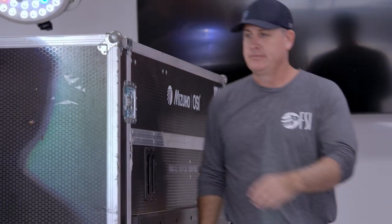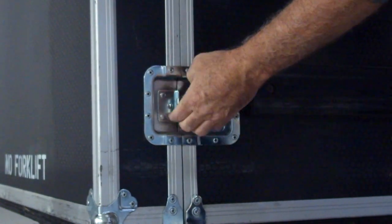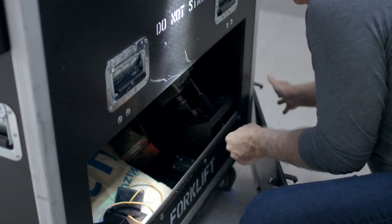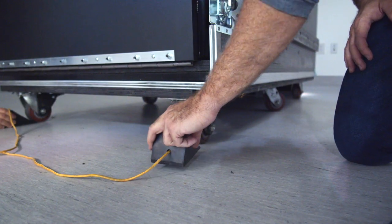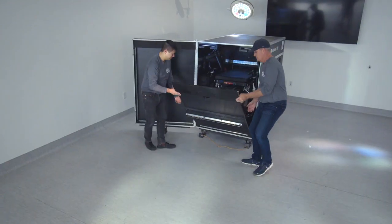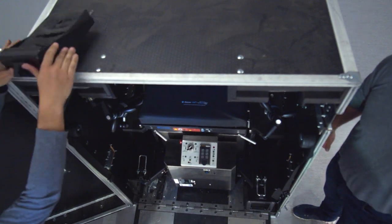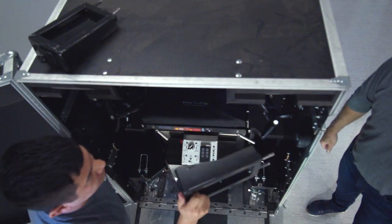On the right side of the crate, unlock the top and bottom latches. Once the latches are unlocked, open the crate door. Head towards the back of the crate and open the lower door. You should find in the bottom door a pair of wheel chocks. After getting the wheel chocks out, place them on the front casters to keep the crate from moving when you pull the table out. Unclip the strap that holds up the ramp and lower the ramp to the ground. At the bottom of the crate, remove the two table blocks by pulling the lever forward and then back. Once removed, set them on top of the crate so they will not be in the way.